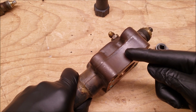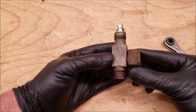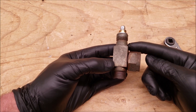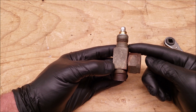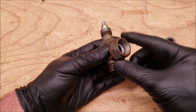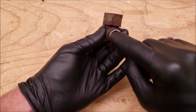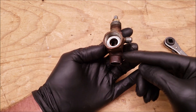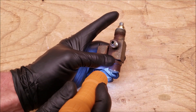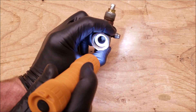This is the suction side, so let me show you what a liquid one looks like — I'm actually going to show you a king valve next. This is another three-position service valve, but this one is attached to the receiver tank, and because it's located on the receiver tank it's known as the king valve. This one can be used to pump the system down in an automatic or non-automatic pump down system. This connects to the side or the top of the receiver. In the front seat position, all the way down, you are no longer connecting the receiver tank to the liquid line.